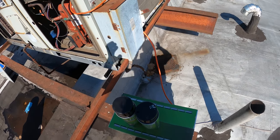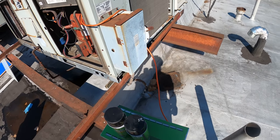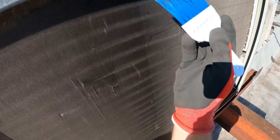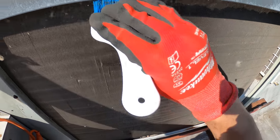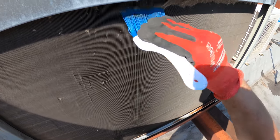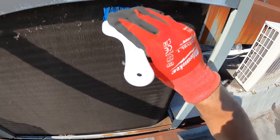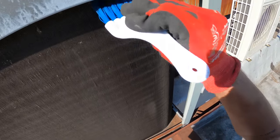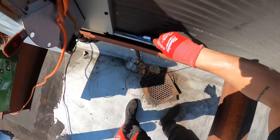You really want to rinse this coil well when using this acid because it is no joke. Before you apply it, give it a light brush — you can see there are a lot of debris here, so you want to get rid of that first before applying the acid, otherwise it's going to be hard to get off. Just brush down the coil where you can for those heavier pieces of dirt and you'll be all right.